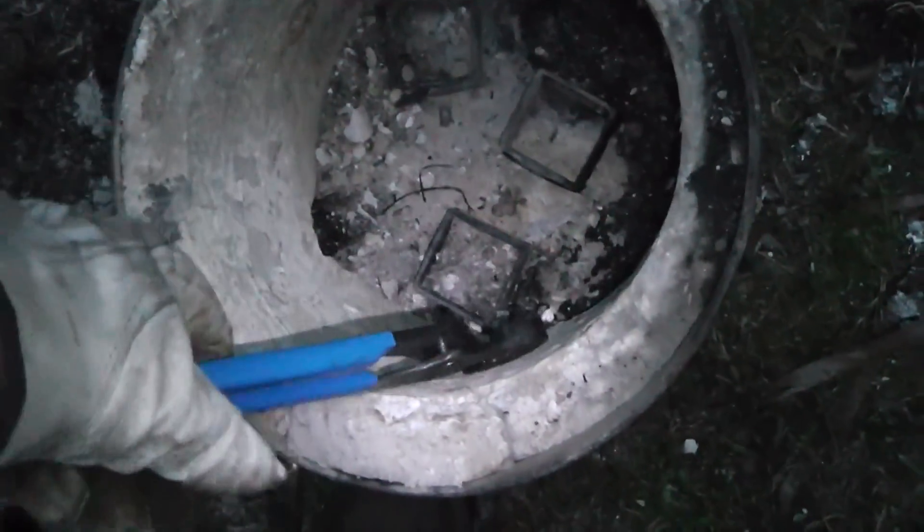It probably needs to be a little bit bigger, or I need to cut down on the amount of fuel I'm sticking in the thing. But if you look down here, these are my trivets — that keeps the crucible up off the bottom. That's my crucible right there. It's just a stainless steel pot I got out of some thrift store for a buck. This is just 2x2 box steel tubing that keeps it up off the ground.